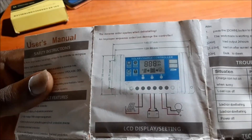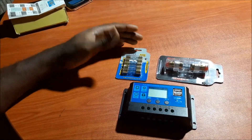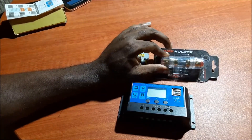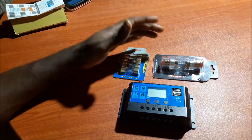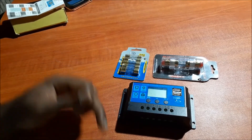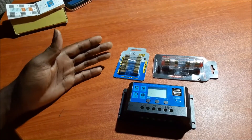This is the full diagram, so you need to ensure that everything is connected properly. If you are confused about your system setup, there are inline fuses you can put in for safety depending on your situation, and also inline meters you can install to see how many volts go into your battery and how many volts are coming from your panel. I'll put all of these links in the video description.